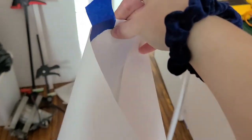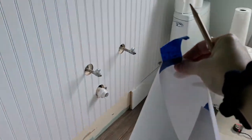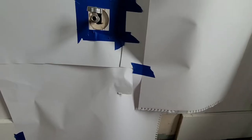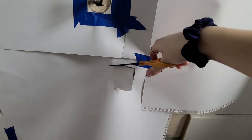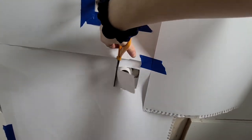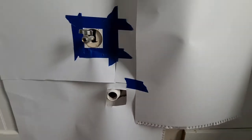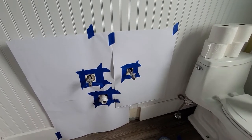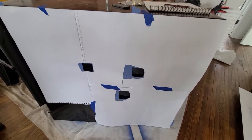I took some large sheets of sketch pad paper and taped them to the wall where the cabinet was going to go, then took a pair of scissors and cut around those pipes to figure out exactly where I was going to drill the holes in the back of the cabinet. One thing to keep in mind: you need to flip the sketch pad paper to the mirror image side on the cabinet, otherwise the holes would end up too far to the right. Take it off the wall and flip it onto the back of the cabinet like you see here.